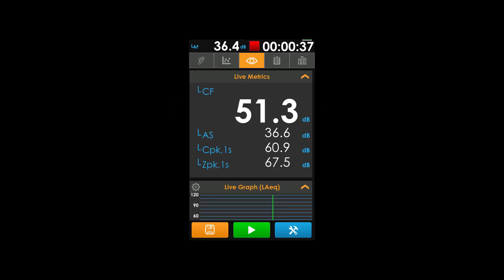Now at the end of a measurement, the meter will be in a stop state and wait for the user to either: 1, hit the run key to start a new measurement because we are at a new location, or 2, hit the store key to save all pending measurements to a single file. Since we are conducting a site survey, after the meter completes the current measurement, we will move on to the next location and hit the run key once we are set up at the new location. Once we have measured at all locations, we will hit the store button to save all of our measurements to a single file.